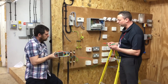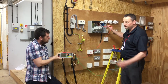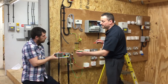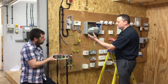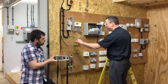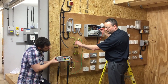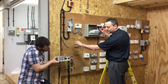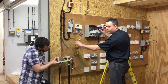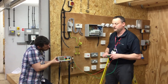We're going to probe onto the least dangerous conductor first, which requires us to probe onto the earthing conductor, and then we're going to probe onto the line conductor. We'll see the voltage to start with, and then we've got our reading for our external earth fault loop impedance. Earthing conductor first, then to line — we should see the voltage to start with. Our external earth fault loop impedance is 0.43 ohms. We come off our line conductor and then off our earthing conductor.